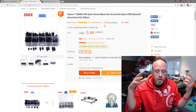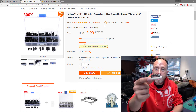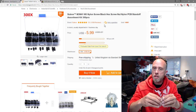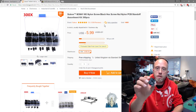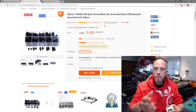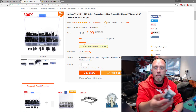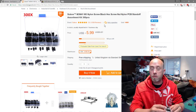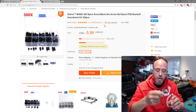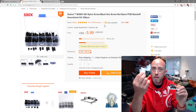If you don't want to buy them from Banggood, you can get them from local electronic stores — Maplins is a suggestion. They allow you to mount the board up off the floor of the model itself, because underneath all of these boards there are always components and you won't be able to get a level board placement otherwise. For a couple of dollars more — 300 of them, a lifetime supply of M3 standoffs — you can mount your board correctly. I'm also showing the balsa wood option on purpose, in case you don't have a 3D printer available, and I'll put links to the 3D printed version in the description.